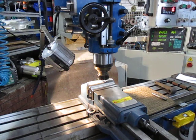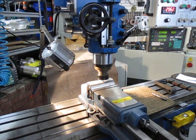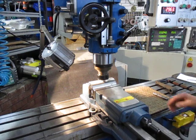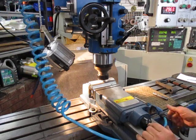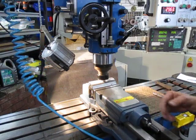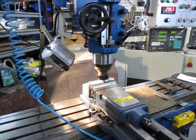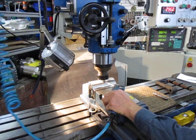I'm running at about 3000 rpm and taking about 10 thou or so at a time. It's a good check to see that the ball nose isn't worn — there's no way of feeling it, so the only way I know I'm going well is by going one way and coming back again, and if it's not taking any shavings, that's a sign it's done its job. So we're going down another 10 thou and I'm using air to evacuate all the chips.